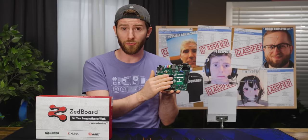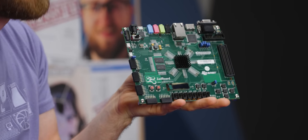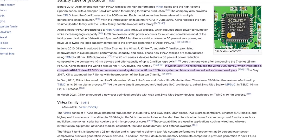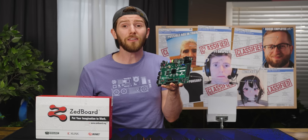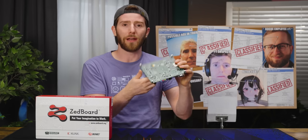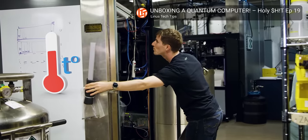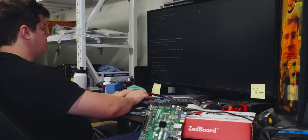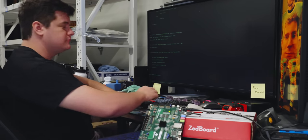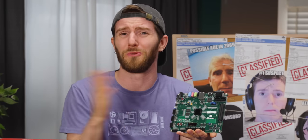Coming back to the Z board that Iran showed off, the reason it's so weak is because it isn't even new. The Zynq 7000 SOC family was introduced in March 2011 and the Z board followed a year later in August of 2012 — just a few short months before the world was supposed to end. And while I'm sure that someone, somewhere, can use it for some part of the chain — maybe to monitor the thermostat of your quantum computer, the coldest place in the known universe — realistically, this is a basic dev board that's meant for people wanting to try out FPGA or prototype a very basic ASIC before they move to mass production.